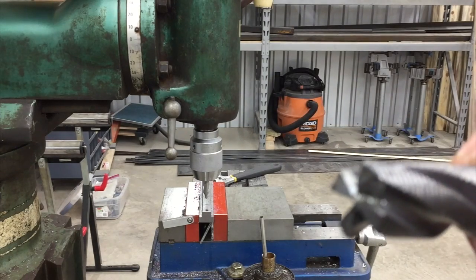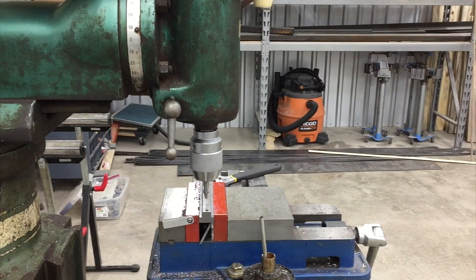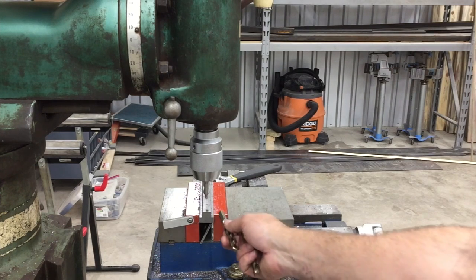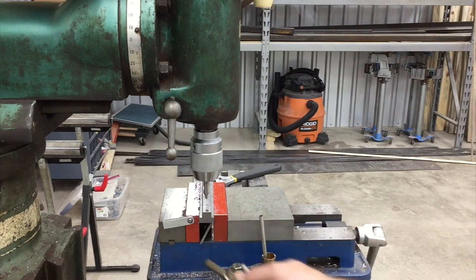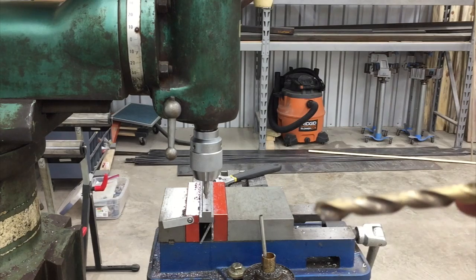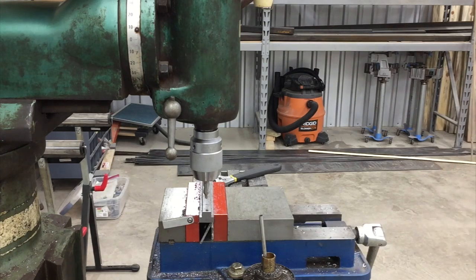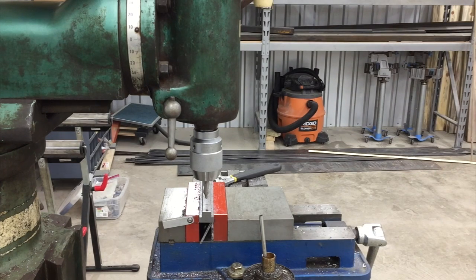It's really maybe a little bit on the big side for this machine, but it handled it okay. To drill the holes, we're going to use a center drill to get it started, and I'm going seven-sixteenths 20. A lot of the T-nuts have a fine thread on them. I messed up and got this a little bit too narrow to make a half-inch, so we're going to go seven-sixteenths — it'll work for this. We'll start with a random drill bit to get some size in there, then do the tap drill size, which I believe is 25/64ths.